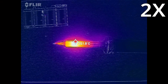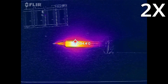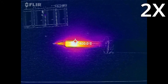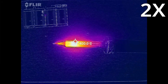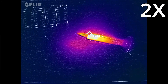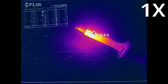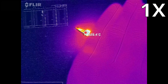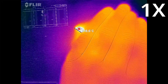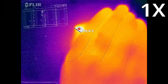We go far beyond the set temperature, and at 400°C my thermal camera no longer captures the actual temperature. I certainly did not expect this. After a while the temperature comes down and settles around the temperature set on the dial. When covering the hotspot and only exposing the tip to the thermal camera, we can see the temperature is almost spot on — the Vela hovers between 300 and 320°C.